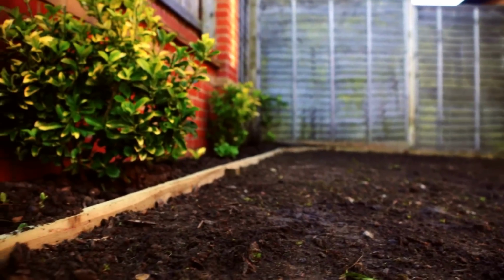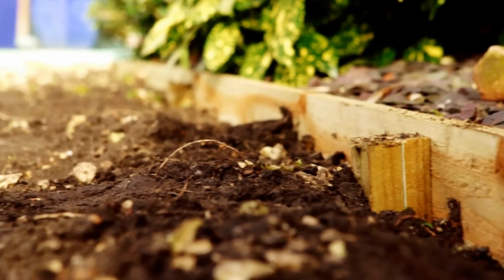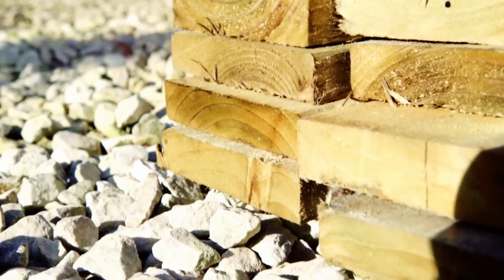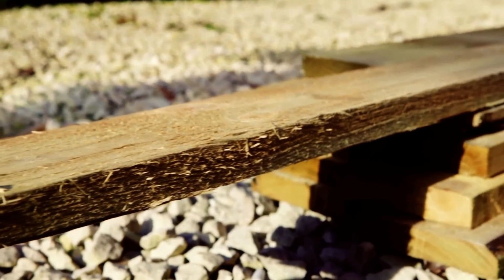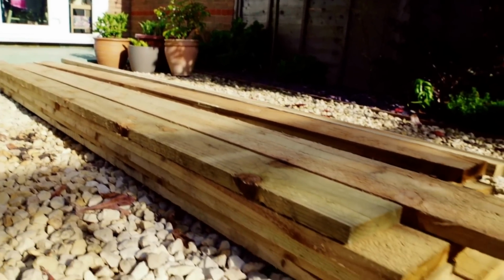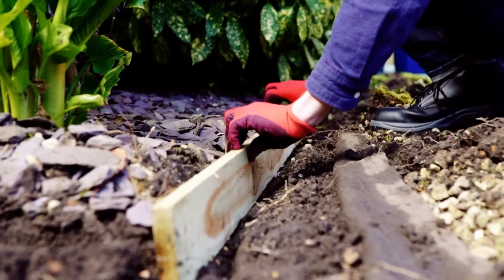Timber edging is the preferred method to secure your artificial grass and to prevent movement. The framework should be about 19mm thick and 100mm deep, and should be made from treated timber, with any cuts treated before your installation with an end grain preserver to help prevent rot. The framework then needs to be secured into the ground using wooden stakes.